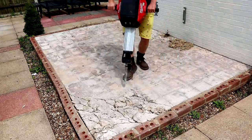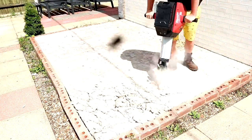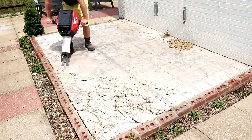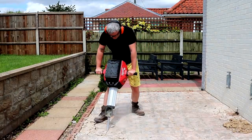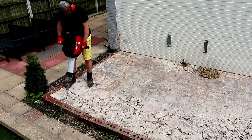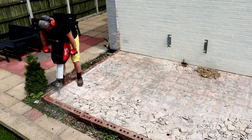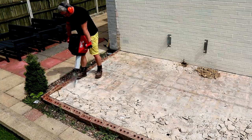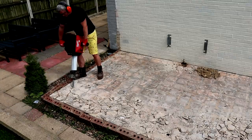I really didn't know how long this was going to take having never done anything like this before. I ended up breaking it all up in two sessions. The battery life of the tool was really impressive — each time I broke up the concrete I was exhausted before it was, so I could just pop it on charge ready for the next session. According to the Milwaukee website you can break a 40 foot by 1 foot, 6 inch thick piece of concrete on one charge, and I think that correlates pretty well with my experience. I did this whole slab on just two full battery charges.